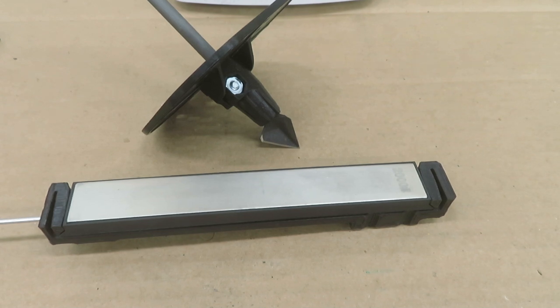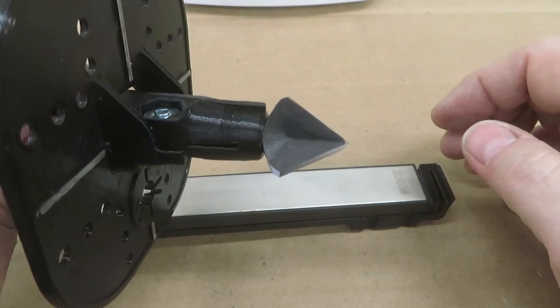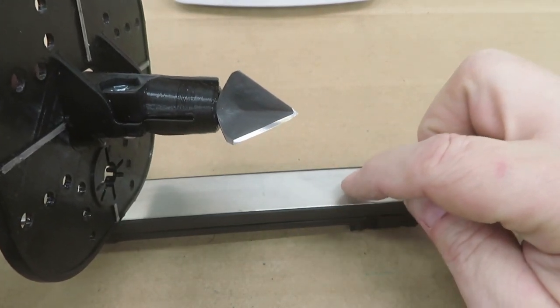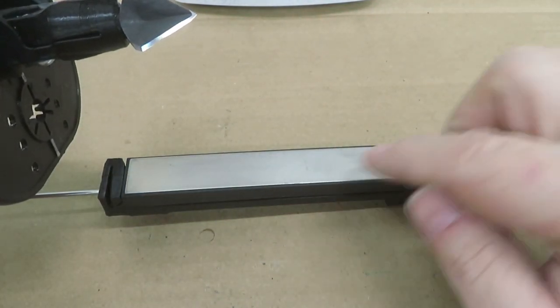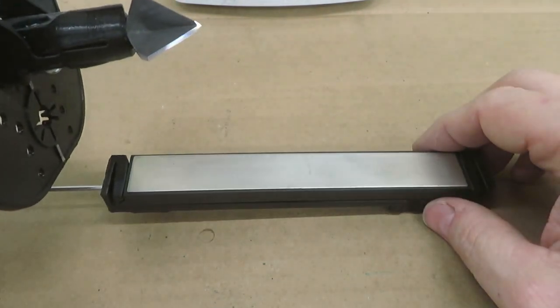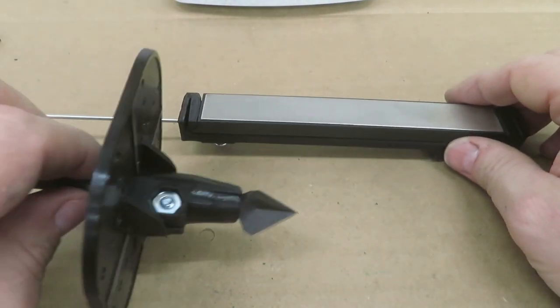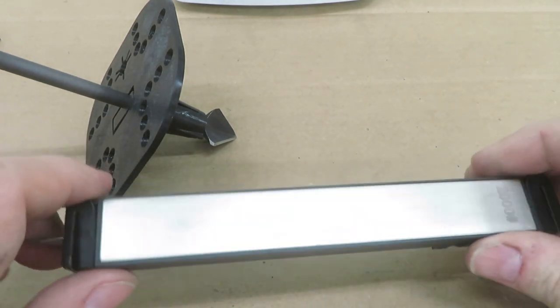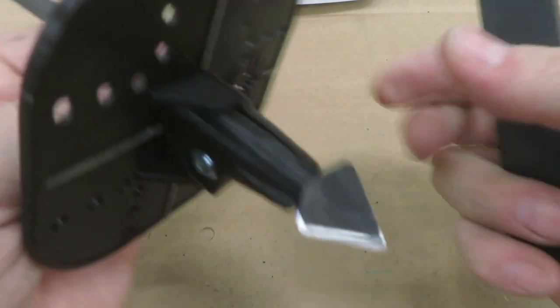And then the most important part is making sure you keep these diamond plates dry, because this is a steel head. Anything trapped in here that remains behind is steel. If these get wet, it'll look like the plate is rusting. Diamonds never rust. What would be rusting is any of the steel left in here, so don't let these get damp.